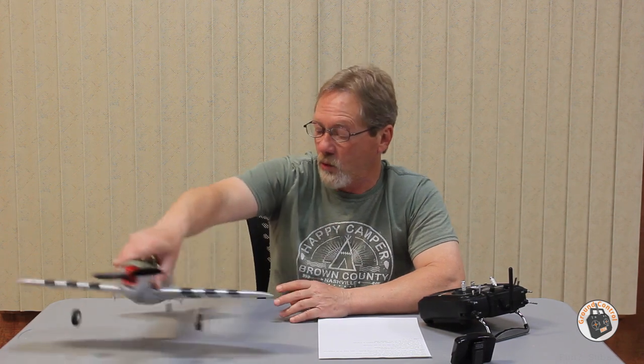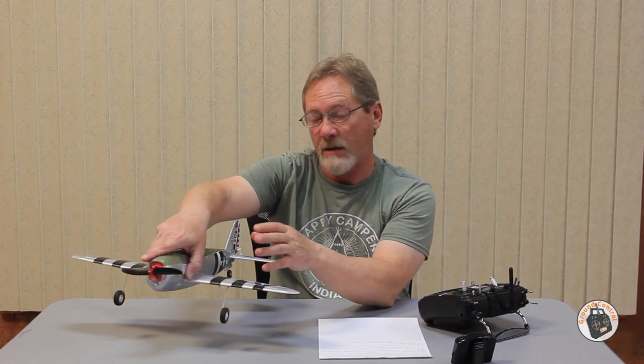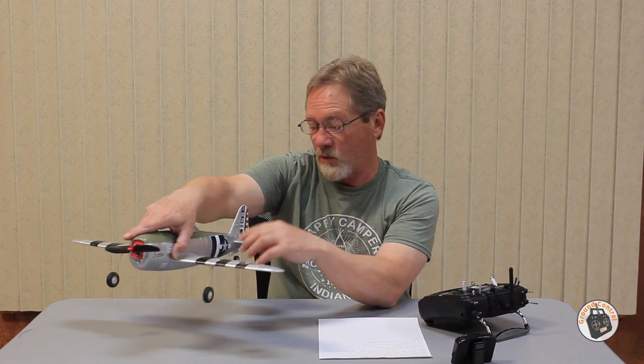It certainly is probably the absolute cleanest brushless conversion I've done so far, but that's because of the way the plane is put together — it made things a lot easier — plus the brush-to-brushless module. Don't forget about that. There are links to all of that stuff in the show notes — to the module, to the plane, and I think a couple of links to the V761 board — the proper one that you can mount right side up. If you do decide to use that board in this plane for a brushless conversion, be aware you're going to have to modify the elevator linkage. Stay tuned — we'll see if this is going to be a success or a failure. You never know until you launch it. Thanks for watching, and I will see you in the air.